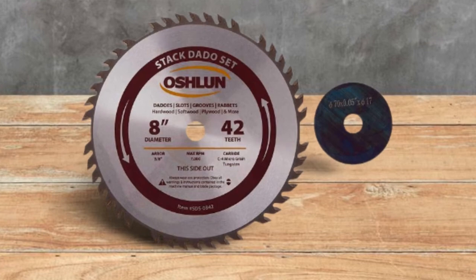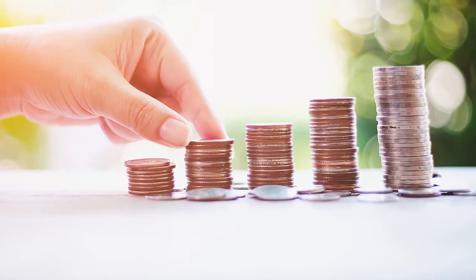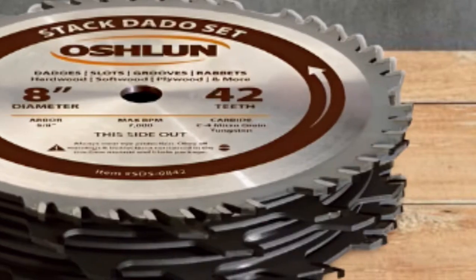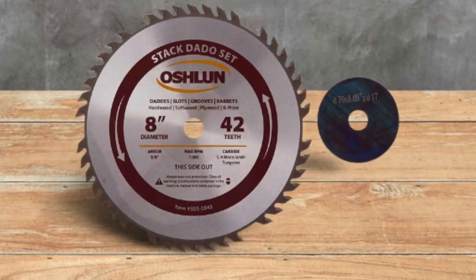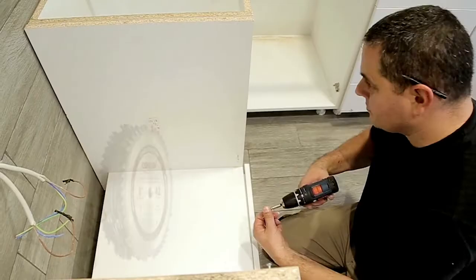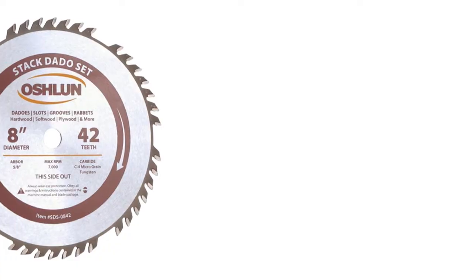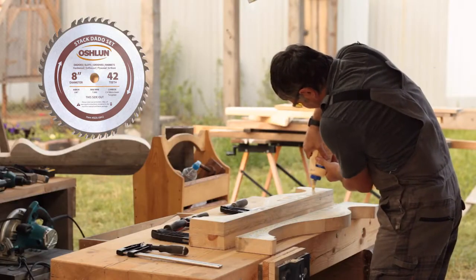As an added bonus, the blades come with thick shims so you can increase your cut thickness if needed. This is a great economical way to achieve clean, burr-free cuts that don't require any sanding or planing. It works even better than many more expensive traditional stack dado blades on plywood, MDF, and laminates. Covered by a lifetime warranty, this dado set provides a perfect flat-bottom cut every time and is ideal for cabinet dados, box joints, tenons, and other joinery. The carbide-tipped blades are completely flat and wobble-free.